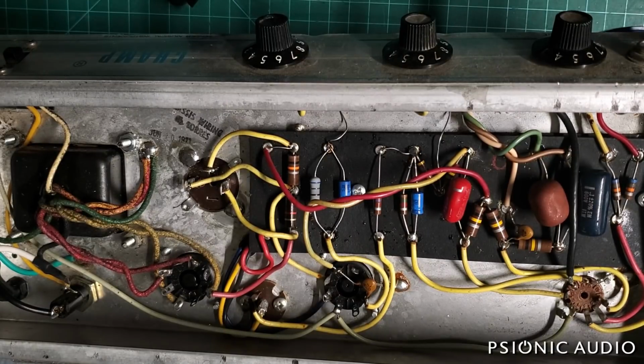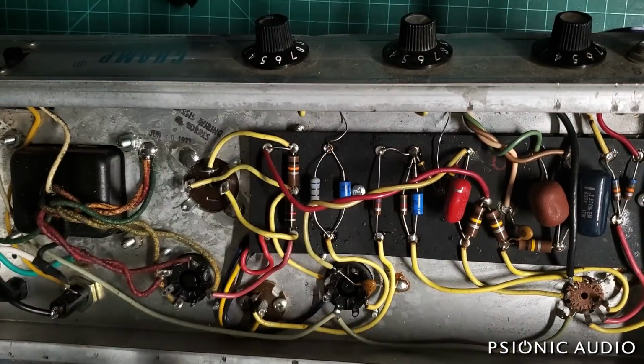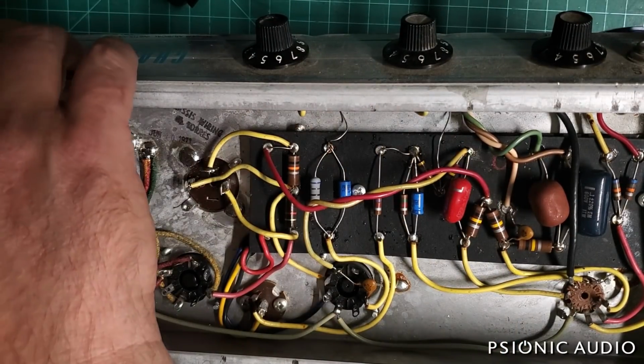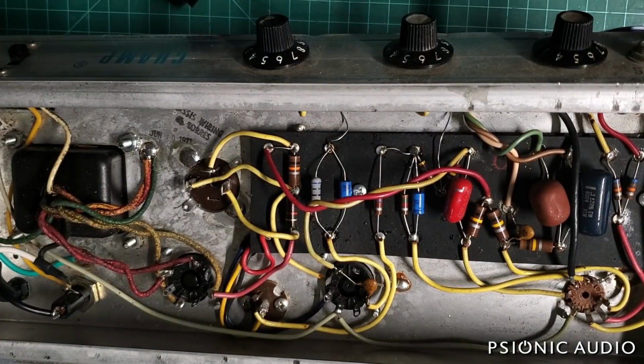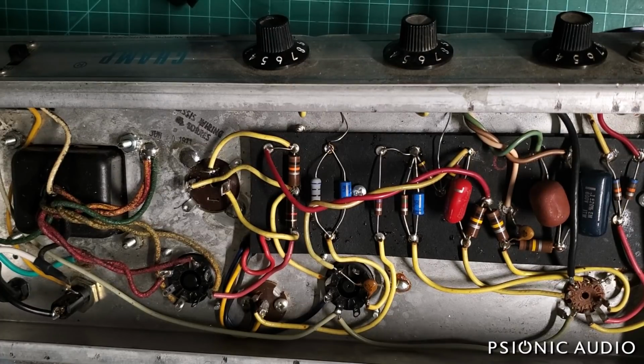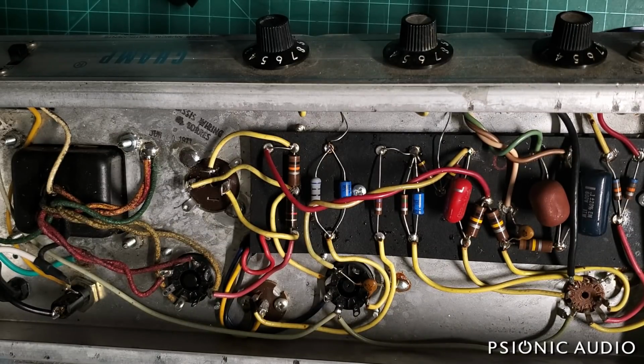And you put that in conjunction with a little 8-inch speaker and a little bitty open back cab, and it's just box city. So I'm going to put a resistor in parallel with that 15K off that bass pot, which I have done for some other people, and it really makes the amp sound nicer. I'm going to let the owner hear it, and if he doesn't like it, I can take it out. But I think it's such a no-brainer improvement to make to these things, because man, it's just mid-city, and the tone stack doesn't do much with that much mids. So let me do that real quick, then we'll hear it through its old speaker and see what that sounds like.